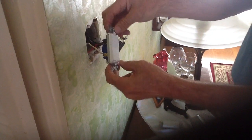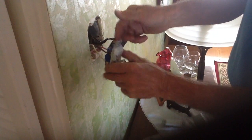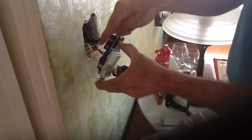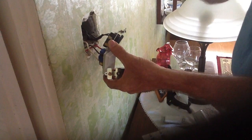That's the decor switch toggle — nice and white, it's going to look good on this particular wall. Black screw is common, traveler, traveler. Normally speaking, black is always your power wire or your switch leg wire, and the white and red are usually the travelers, so you can switch in two directions.